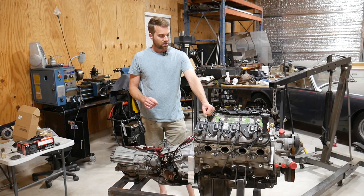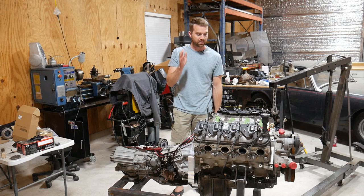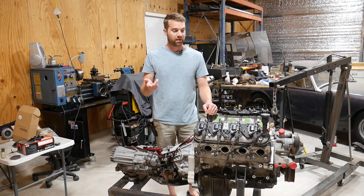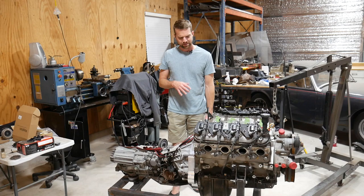So with everything in place, it's looking pretty good. The only hiccups I ran across were the alignment of my hole in the tubing for the engine mount itself. Not the plate pieces, but the actual vertical piece of tubing. I don't know if it was my drill press or just the way I aligned my jig to start poking holes in it. In any case, I missed by a hair in both directions, causing that bolt to want to walk a little bit. So that's why there's a little bit of misalignment there, but I'll clean that up with a die grinder.